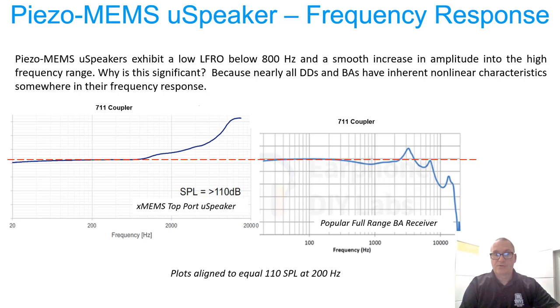If you're playing back music on YouTube Music or Amazon Music, streaming through your laptop, and configured with the APO software into our EVK kit, you can enable the equalizer and attenuate all of the highs and mids to your liking, shaping the frequency response to any profile you'd like — the Harman curve or other. One thing I've noticed about working with Montera is that the speaker takes EQ really, really well, and I don't have to boost anything. With equalization, it's always better to cut than to boost, and that's exactly what Montera gives us.